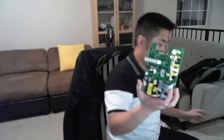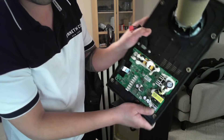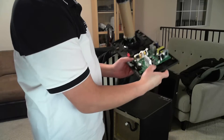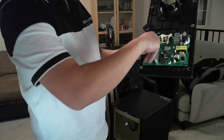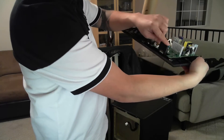To test it, I'm going to take apart my subwoofer, which I've already mostly unscrewed. My board is also using the old one. Important note: the ribbon cable — once it's repaired, or if you don't insert the ribbon properly back on, it will not power on. So make sure you put it back in evenly because it needs to detect the daughter board. There's a little small border inside it too.